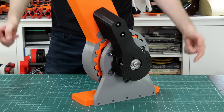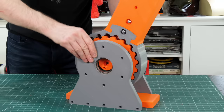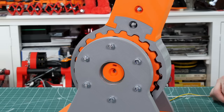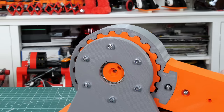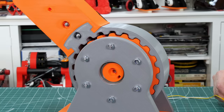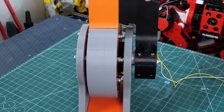With the motor back in and the outer casing on, all we need to do now is put the front on, which has a bearing that fits onto the middle of that cam, and then this piece attaches to the base and everything's in one piece — bolted up and screwed onto the base. There's our motion and we can see the output's turning, although it looks a bit like that casing's flexing in a rather weird way which wasn't planned. The cycloidal disc touching it is actually causing the casing to flex really badly — it's making a really bad laboring sound, and you can see the whole thing twisting as those discs walk opposite each other, stretching the gap between the handle.